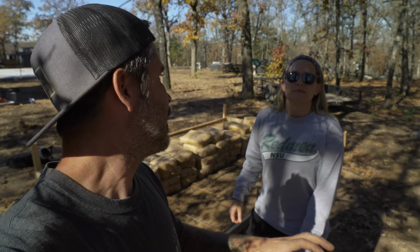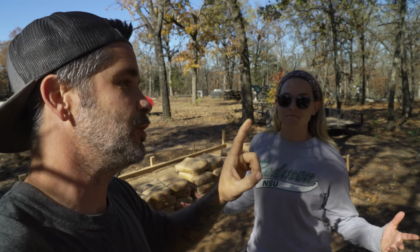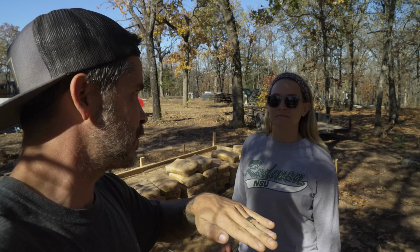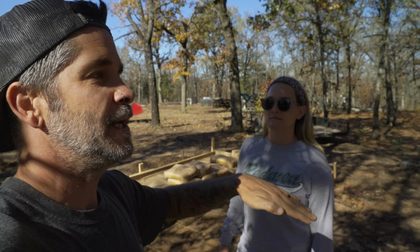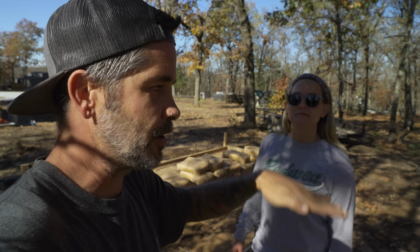We've got this. All right guys, so this is what you've been waiting for. It's time to bust bags. Luckily it rained and it packed the dirt in, but I do think we're gonna get moisture from the bottom and the top. So I think we're gonna have to somewhat work quicker, because once the bottom gets wet, it's gonna start to harden. And then you guys know dry pour, you start on the top and then let it dry and then it goes down.